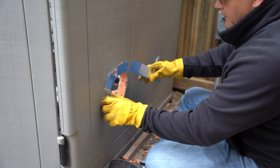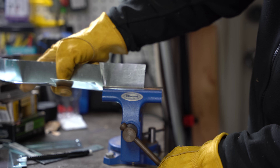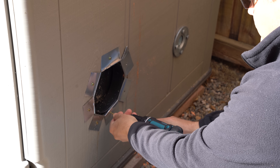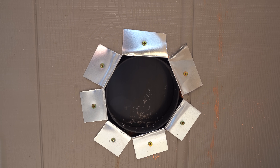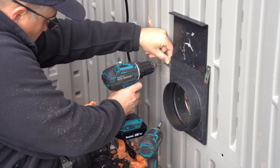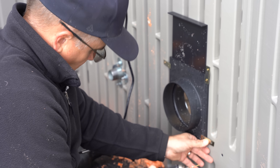Now that I made the cuts I was able to line this up and put it inside. I noticed that the metal is pretty rounded on the edges so I went ahead and put it into my clamp to tighten down and really get those edges nice and closed off so I don't have the round edging around each one of the tabs. I slid it back into the hole between the blast gate and the wall and then just screwed it down with some simple screws. On the other side I wanted to mount the blast gate securely up against the wall. I found some small tabs at Home Depot, did some pre-drilling, and then dropped in the different screws all the way around.